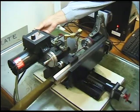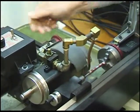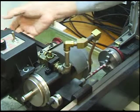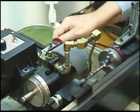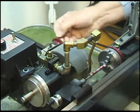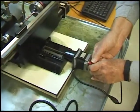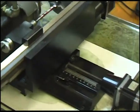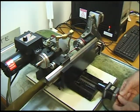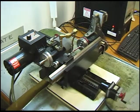The next thing I'm going to do is adjust the wheel and take a couple passes on it. Then I'm going to move in the Y-axis 2,000th of an inch because that's what I dressed off the wheel with the diamond, so that evens it up. I'm going to take about a 3,000th pass and measure it one more time, because we're getting pretty close to the end.